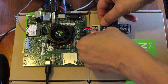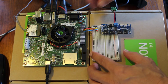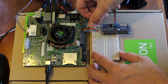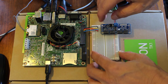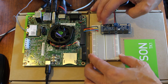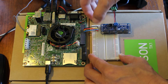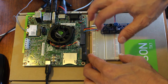So this is our standard I2C wiring. Starting at pin 14, 16, 18, and 20, J3, A1, we have the ground, we have power, and then we have SDA, and then SCL, the clock. And then those are wired over to the PWM board, into the ground, the clock, SDA, and VCC. There is something on here called V+. That's to actually drive the servos if you want to drive it through the little pin here.